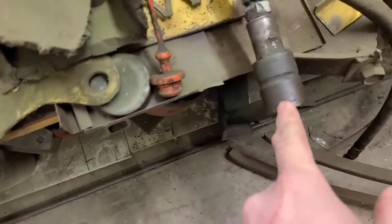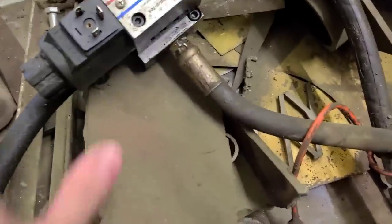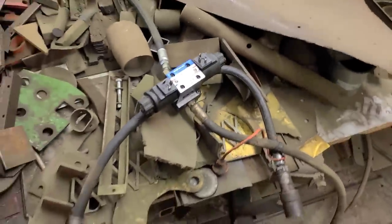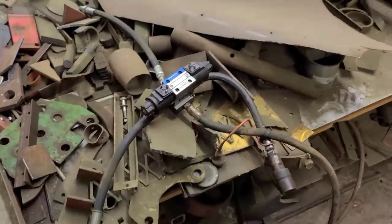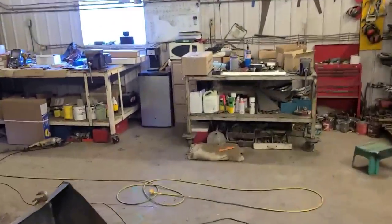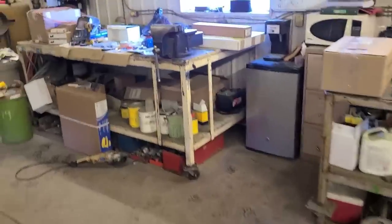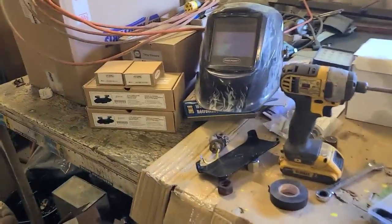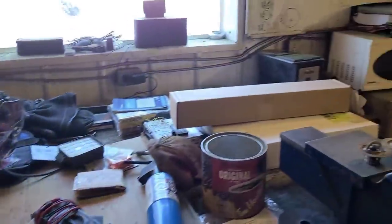Here's the valve together, so here's your hookups for your grapple fork — your in and your out for the hydraulic fluid — and then it attaches underneath just like that. That's that little block. I need to put a new set of o-rings in it because it was leaking, that's why it's on the bench in here. We'll zip outside here real quick, look at the 4640 with one together, and that'll be the best I can do for a how-to video of these joysticks.